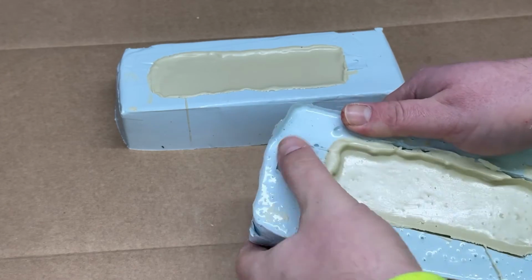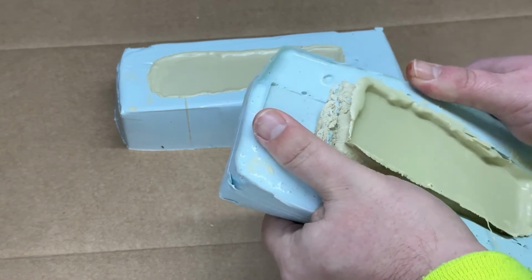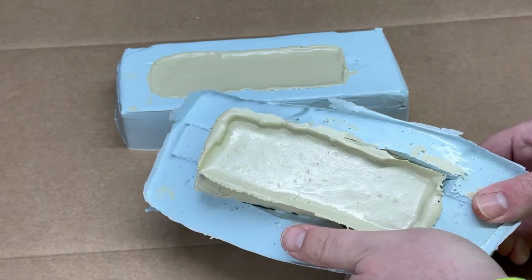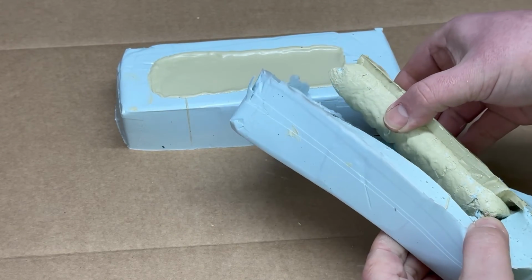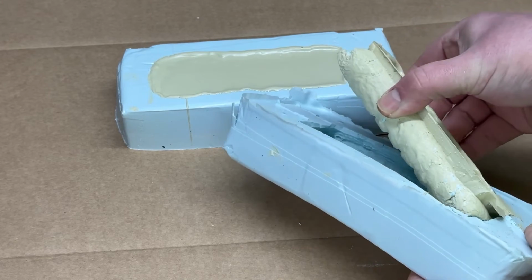Once the resin cast has cured, you can lift out your finished casts. You might find with food products that the silicone will creep into the smallest of areas, and these tiny bits of silicone may tear away, so remove them carefully.